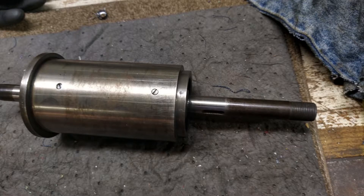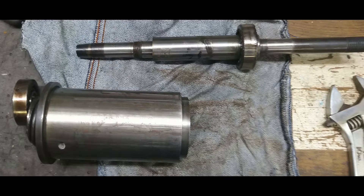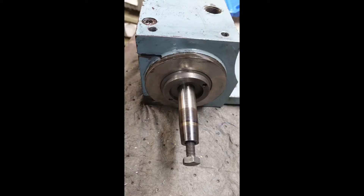The grinding spindle is a round external housing that slips into a bore in a cast iron box, clamped in place with a couple of socket head screws. It's pretty simple really — a decent bearing at each end and a large spring in the middle which applies pressure to remove end float and continuously self-adjusts. Dismantling it is best done in a press so you can control that spring. I replaced both bearings as they didn't feel particularly smooth, repacked with appropriate grease, and reassembled everything. That was another simple part of the project.